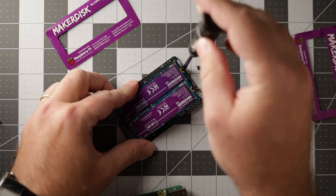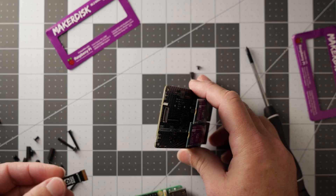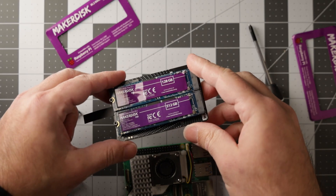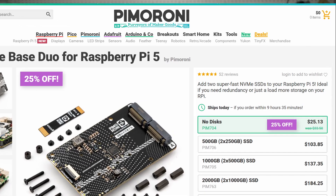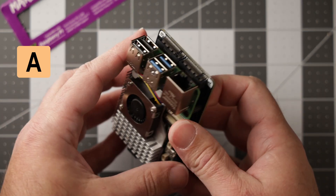The Base Duo has a couple of downsides though. It's a little fiddly to put together, but a lot of the adapters I'm reviewing today are fiddly. I started assembling by putting the drives in first but that blocked the PCIe connector — I had to remove the drives, put in the PCIe cable, then put the drives back in. So you probably don't want to be taking these apart very often once assembled. Although the Pi 5 can be configured to use PCIe Gen 3 speeds, the Base Duo only has a Gen 2 switch, meaning there's no way to get Gen 3 speeds on it. The Base Duo costs a little less than $35 US and I think it offers pretty good value if you're looking to add storage or keep the OS separate without using an SD card. I'm putting the Pimoroni Base Duo in the A tier — it basically doubles the size of the Pi 5 and adds $35 to your setup, so it's not quite S tier.